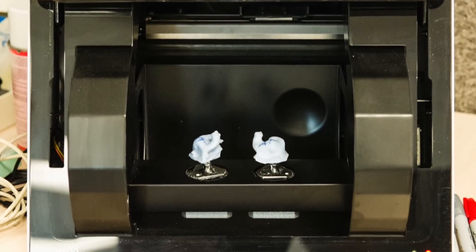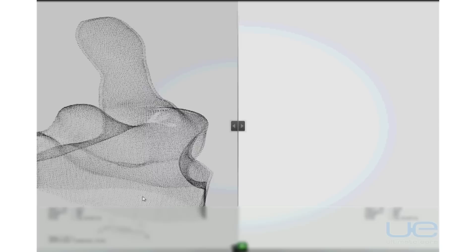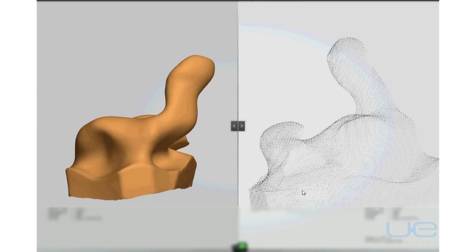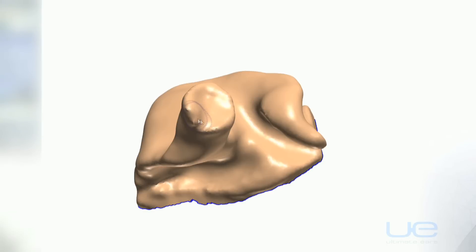This new process still starts with the silicone ear impressions. But what happens after they're received is quite a different operation. After your silicone impressions arrive at Ultimate Ears, they're placed into a high-resolution 3D scanner to create a digital three-dimensional model of the impressions. Instead of carving, cutting, or physically adding material to the impressions, all work is now done in the digital domain on the 3D model. People who previously detailed impressions physically have been trained to do it virtually. Cuts are still made, material is shaved off, smoothed, added, and cut away — but all digitally.